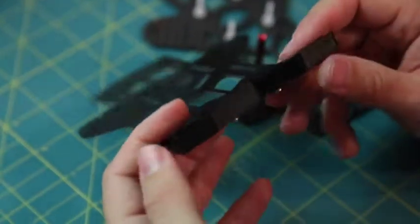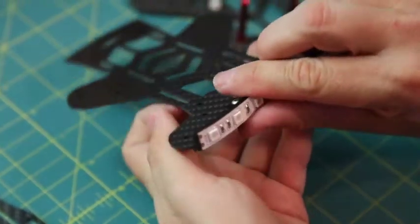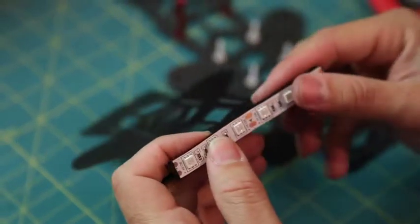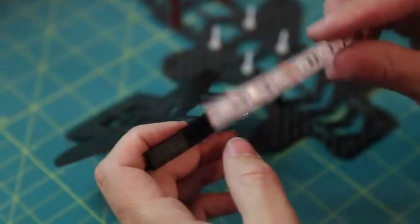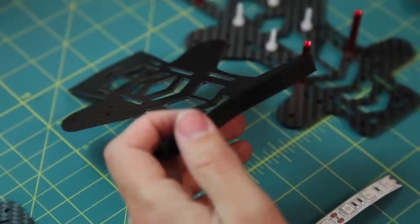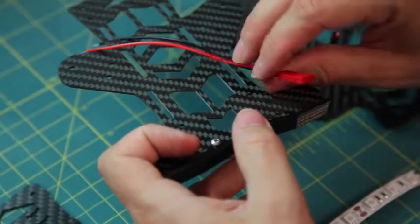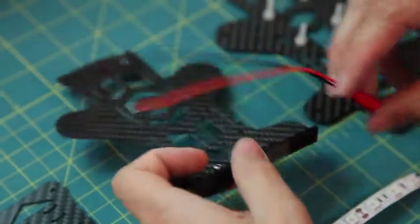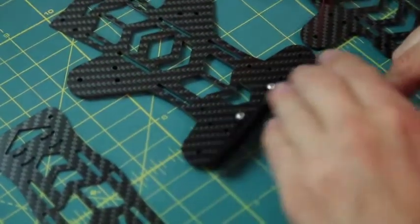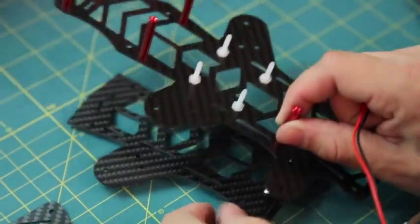Take this time to feed your LED wires. I also recommend taking some super glue and super gluing these LEDs on — they get really hot and are very bright. Run your JST wherever it needs to be so you can have it connected off of your power distribution board, with the other end of your JST plugging into it. Once that's all done, your ESCs are in place and your bumper's in place. Now move on to putting the two plates together with the arms.